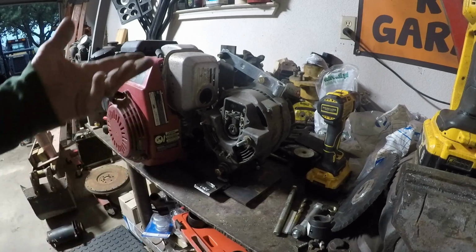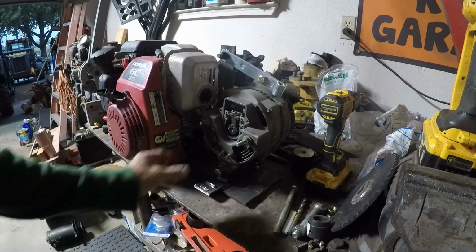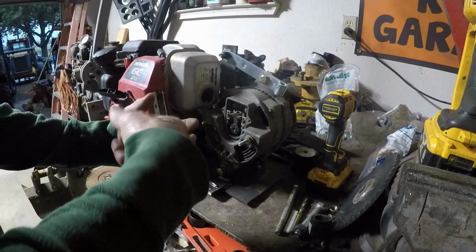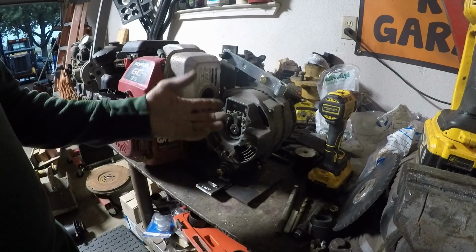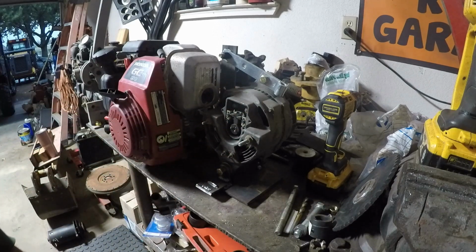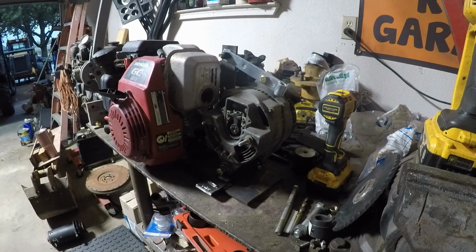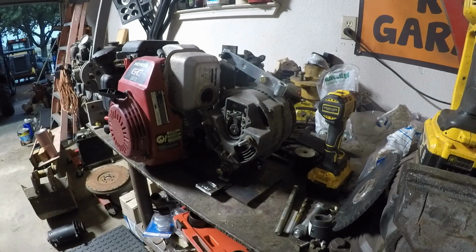And of course, this come right out of a truck from a wrecking yard, had the same diodes and everything. And he said, you just take this piece off. It had a little cover with the gel inside it, and it was basically your voltage regulator. He said, just take that off, cut all the wires, and you can put it back on there to cover this up. And that'll be your welder. So he gave it to me, and like I said, I brought it home. I used it for a long time welding.